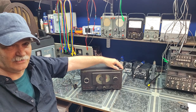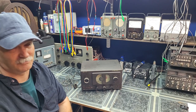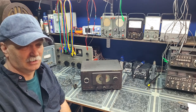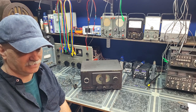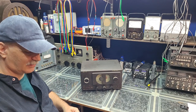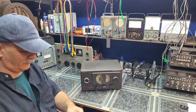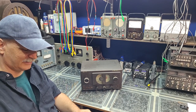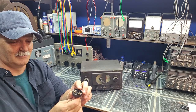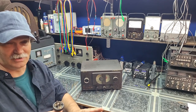The biggest thing with the S-38 is there is a safety problem with it. I'm sure a lot of people have heard about it, maybe don't fully understand what's going on. So I'm going to explain and show through a series of diagrams what the safety issue is and how we're going to fix it. It kind of resides around this power plug. Somebody has obviously put another cord on it, maybe back in the 1960s, a hardware store plug. If you notice, both of the pins are exactly the same size, and this is kind of where the problem starts.